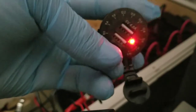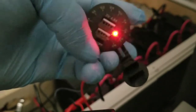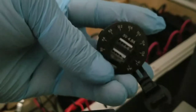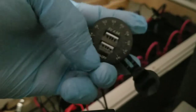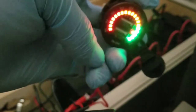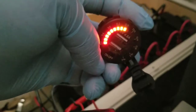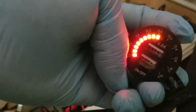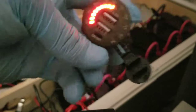If you press this button it's gonna go off and just the standby light shows in the corner. If you want to turn the power off completely, push and hold it — it's gone. These batteries are not completely charged; we have 12.6 instead of 13.8 because they've been sitting for a while, so they're supposed to be on the green.